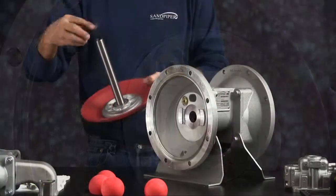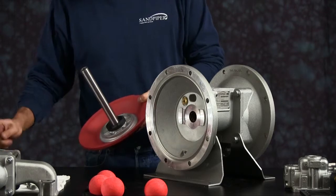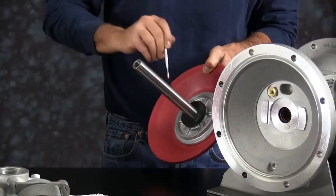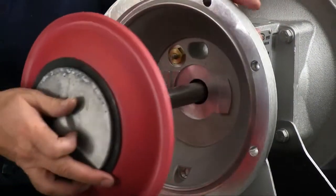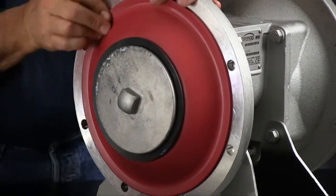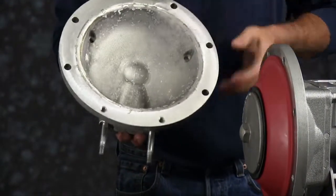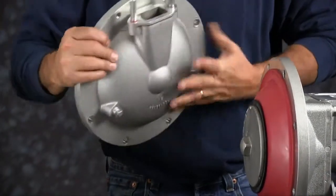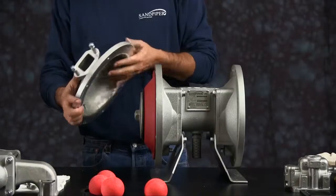Now we want to install one bumper onto the diaphragm rod and apply a light amount of grease onto the rod. Install the diaphragm assembly with the rod into the intermediate. Inspect the outer chamber for casting integrity. Inspect the machine faces and radius of the chamber for damage or material buildup. Scarring, scratches, or material buildup can be cleaned up by using emery paper, crocus cloth, or fine sandpaper.